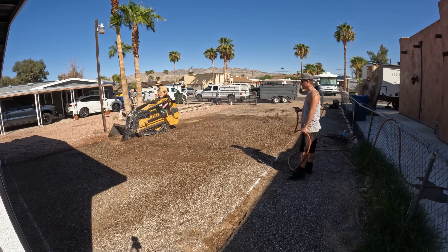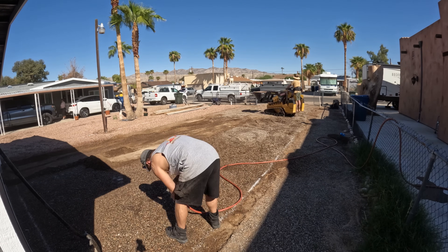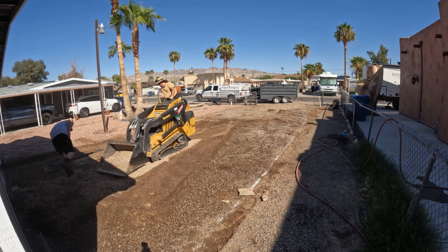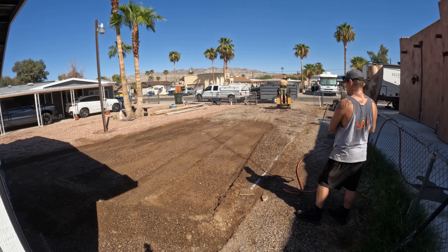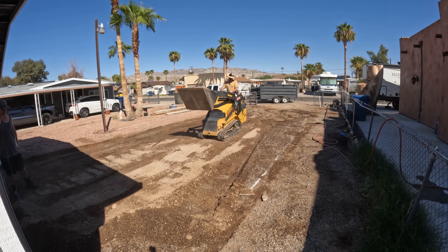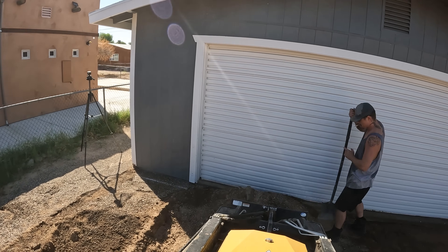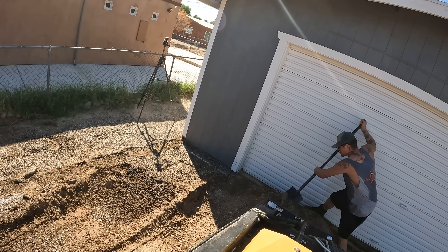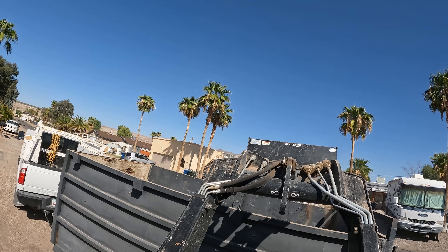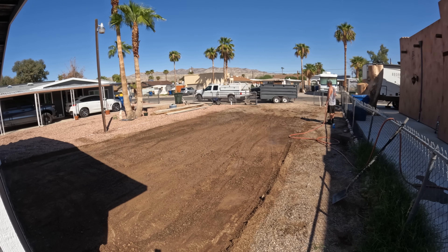The first thing I'm going to be doing here is getting the grade, or getting the elevation of the slab for this foundation. The way I'm going to do that is kind of go off of the existing garage floor — even though we're five feet away, I can eyeball that five feet and just transfer it right on through to the 30-foot carport foundation. This slab is designed according to the plan for a carport, but it's the same structural design as it would be for a totally enclosed garage. Once I get the elevation and the subgrade on that garage foundation, I'll mark out the foundation and start digging the trenches — basically one by ones all the way around the perimeter.